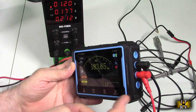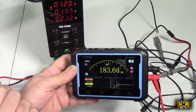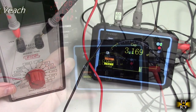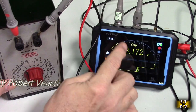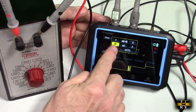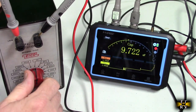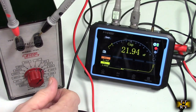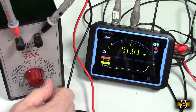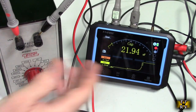Here's an example of milliamp measurement — I've got the milliamp plug-in and common connected, selected milliamp in the gear settings, and it's measuring correctly. For capacitance, I picked capacitance in the gear settings and connected to a capacitance box — it's showing the actual capacitance of different components correctly. That's great for checking capacitors on a car module or electronic component that might be damaged.